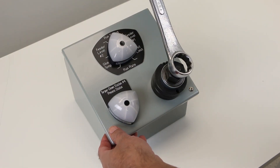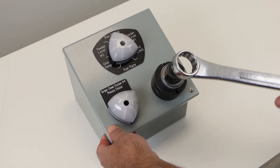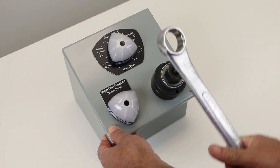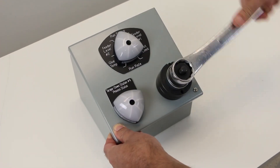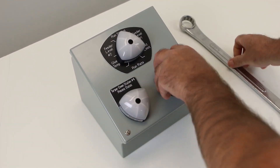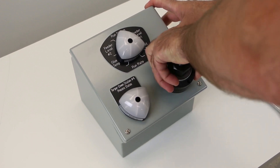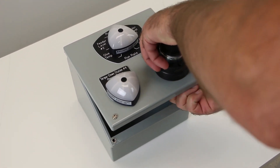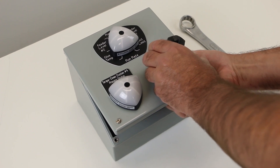This hole was made using a standard knockout punch — every panel shop has them. We have one here; it will show you a little video of it running and how we cut that punch out. Here you can see there's a pilot hole drilled. We're inserting the punch into the hole, simply torque it down and pull it out, and there you have your hole.